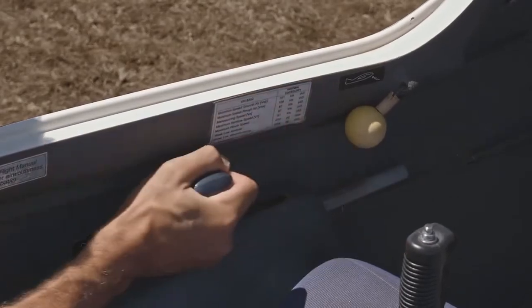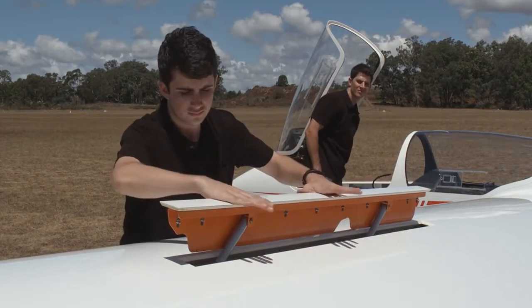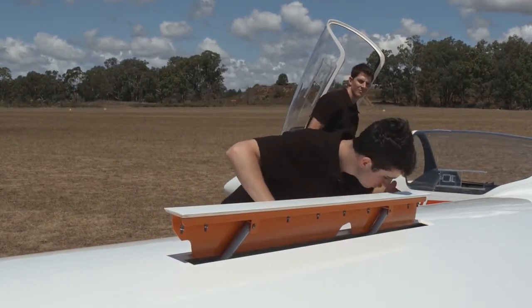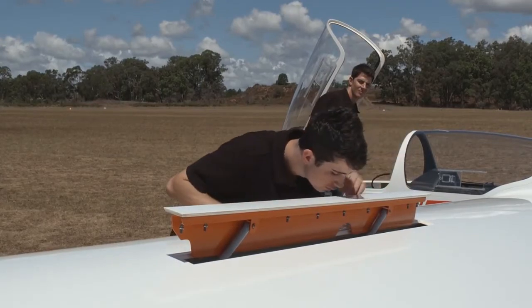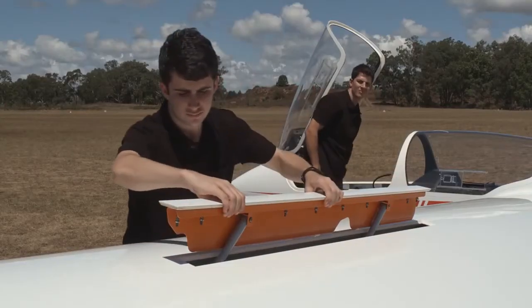Open the air brakes up and inspect the condition and play. Too much fore and aft play can mean bearings are wearing. The blades shouldn't flex so much that they would be prevented from closing under flight load wind pressure. Inside the air brake box, check for the signs of water buildup, as that can cause corrosion of pushrods, or the failure of the structure in metal and wooden gliders. And the caps should be on securely.